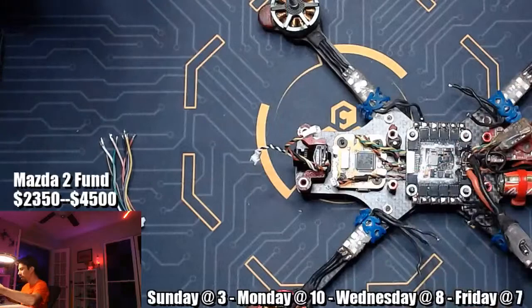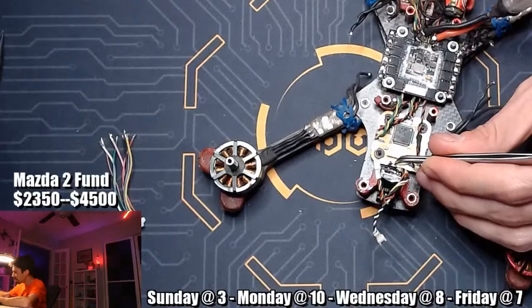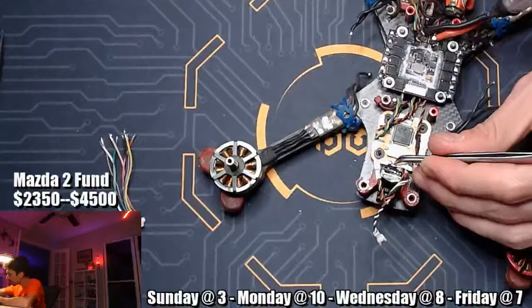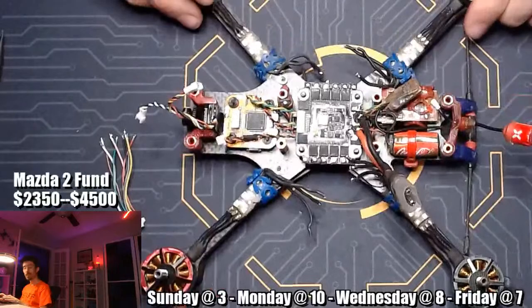Because I have a plug header that's going to be on top of this, I want this wire to be as flat as it possibly can be. So let me just do that real quick here. There it is. Okay, cool. That's what I wanted to see. Nice and flat, dead center on the pad. Good to go. And that, my friends, is how you install a flight controller on a mini quad.